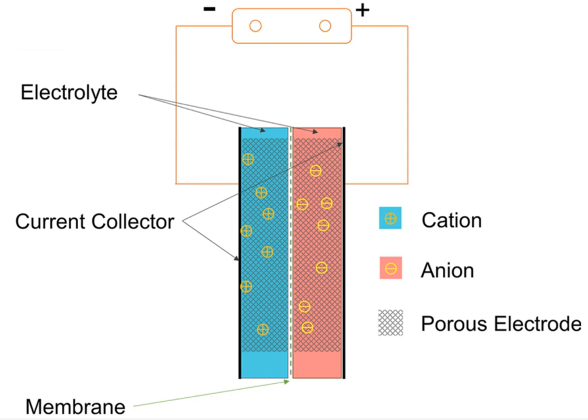It contains several units, each made of 192 capacitors with 2700 F, 2.7 volts, interconnected in 3 parallel lines. This circuit results in a 518 volts system with an energy content of 1.5 kWh. For acceleration when starting, this onboard system can provide the LRV with 600 kilowatts and can drive the vehicle up to 1 km without overhead line supply, thus better integrating the LRV into the urban environment. Compared to conventional LRVs or metro vehicles that return energy into the grid, onboard energy storage saves up to 30% and reduces peak grid demand by up to 50%.